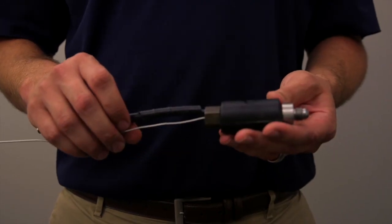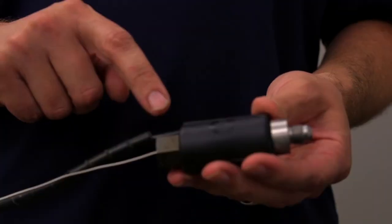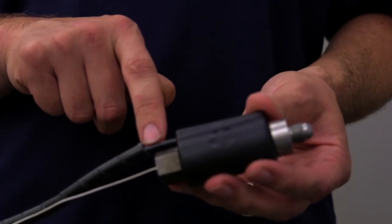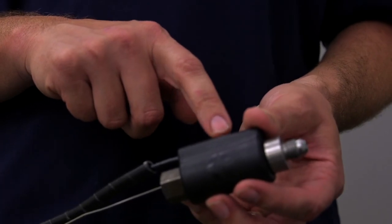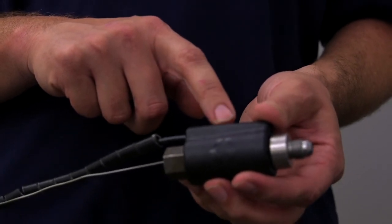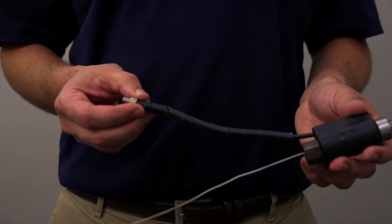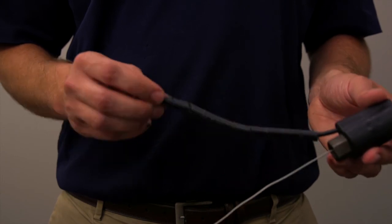Based on some feedback from the field, we also decided to make some small improvements to the fluid temperature sensor. We changed the molded housing so that the wire exited parallel to the fluid path instead of on the side, because when it exited on the side it allowed for chafing on the wire. In addition, we made a change to the connector — the newer connector is a more robust, more reliable connector.